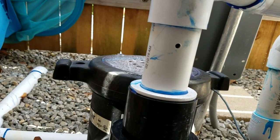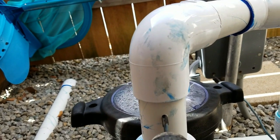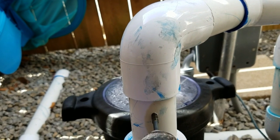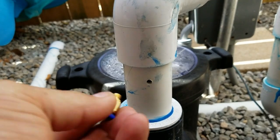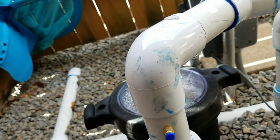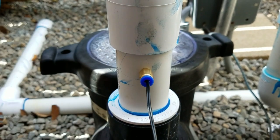I've got my hole. The thread on that connector is 6mm, so I'm going to thread the hole here, nice and slowly. Get the swarf out of there and screw in my connector. I may need to put a bit of PTFE tape around that to seal it, but I don't think I will. I'll carefully push the sensor into the collar like that. Done.